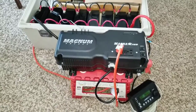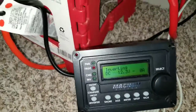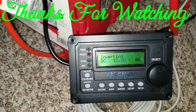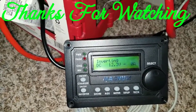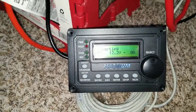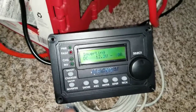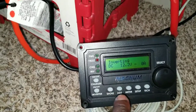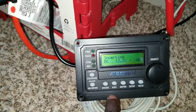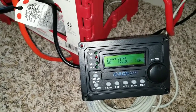I started a test last night with my deep freezer. The batteries were charged all the way to 14.4 volts according to the battery specs. It has been running for 14 hours since yesterday. The battery bank is 22 amp-hours per battery, coming up to approximately 176 amp-hours total. The Magnum's minimum recognized bank size is 200 amps, so I just left the setting at 200 amps even though I only have 176 amp-hours.